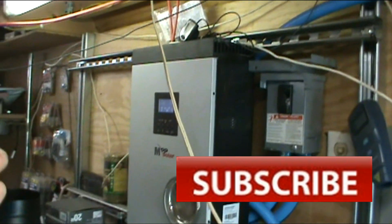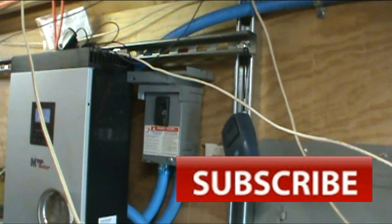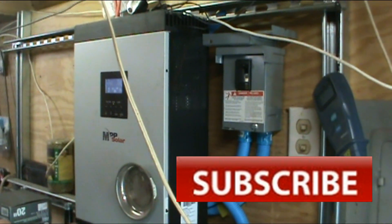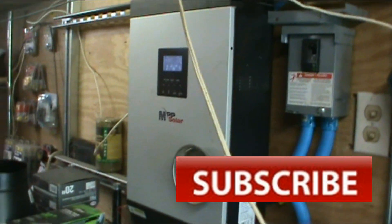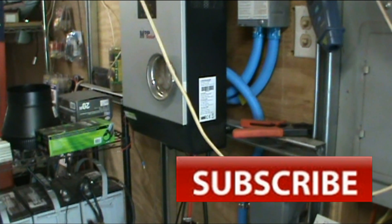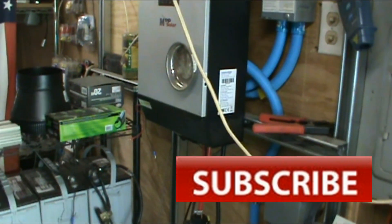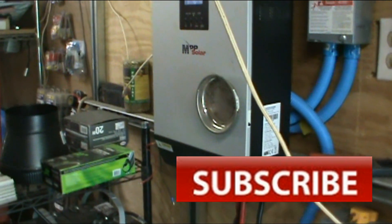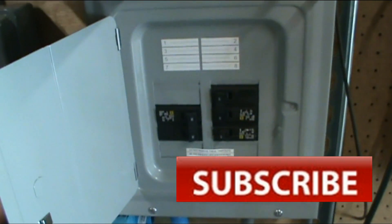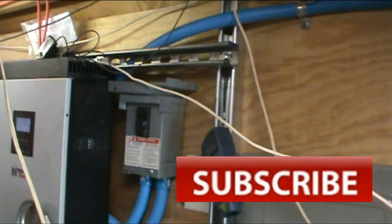My input transformer was done the exact same way — same wiring diagram — except it's a bigger transformer. This one is 5 kVA; I put the 7.5 kVA on the input because the PIP can also charge your batteries. It needs more power to both charge batteries at 60 amps and power appliances at 4 kilowatts. If you take 60 amps times 48 volts and add that wattage to your maximum appliance wattage, that gives you the size breaker needed — which works out to a 30-amp breaker. I've got a 20-amp breaker there because I'm not charging off the grid.